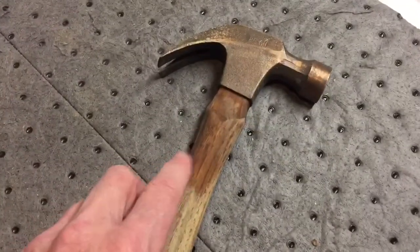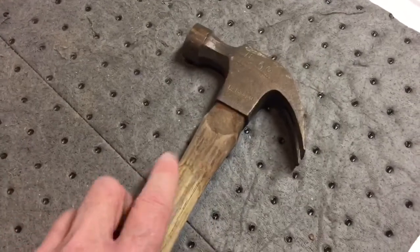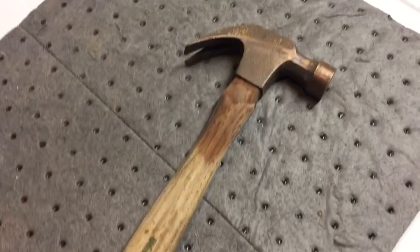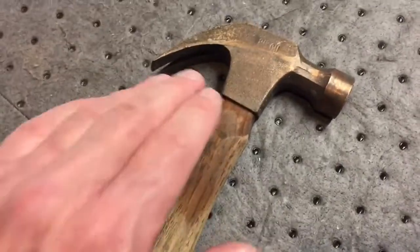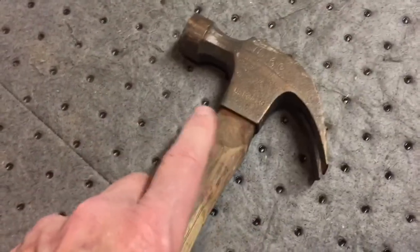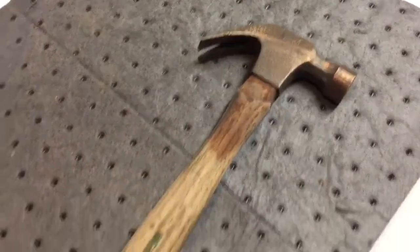Now we're going to give this about another hour so the water absorbs and dries off. You can see already this side is almost dry, and we're going to seal this handle up. Even though this here is side grain, this part at the top is end grain — the wood gets cut in, that's all end grain. That really has to be sealed. That's very important because that's the part that's going to expand and contract.